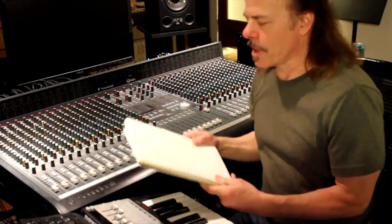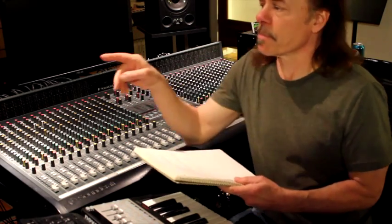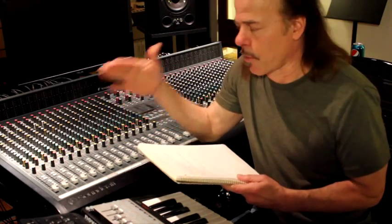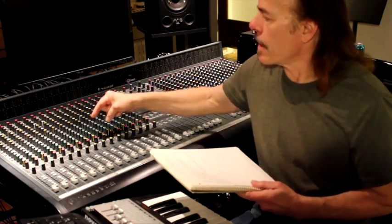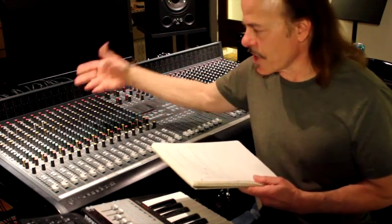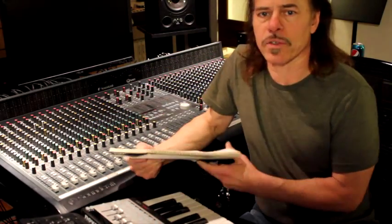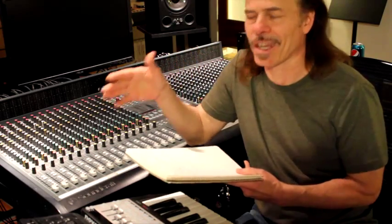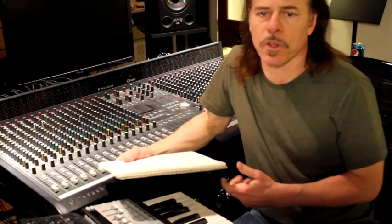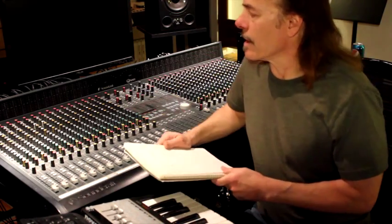Here's my list that I put together the other day. How I created this list: I have a spectrum analyzer in this computer, and I run an output from there into every individual channel — every mic input, every line input, every tape return input. Then I take the outputs from the mix bus, run them back into the spectrum analyzer, and I can analyze each channel to see how everything is working. I can look at the noise level, the signal level, and very quickly I can tell whether there's a problem with that channel and what the problem likely is.